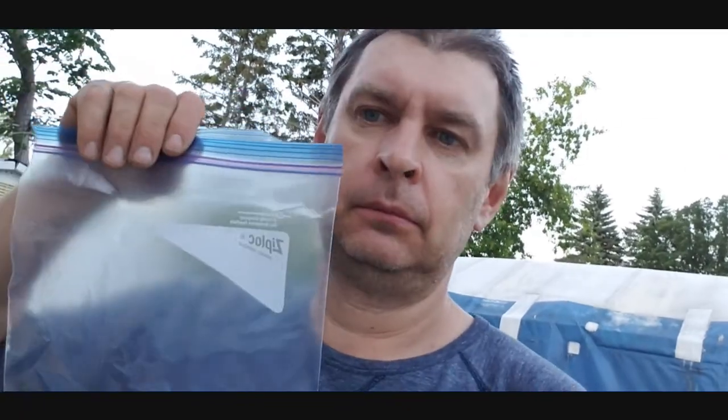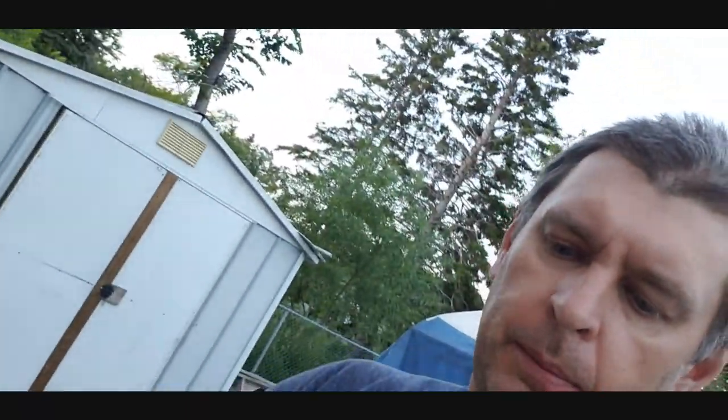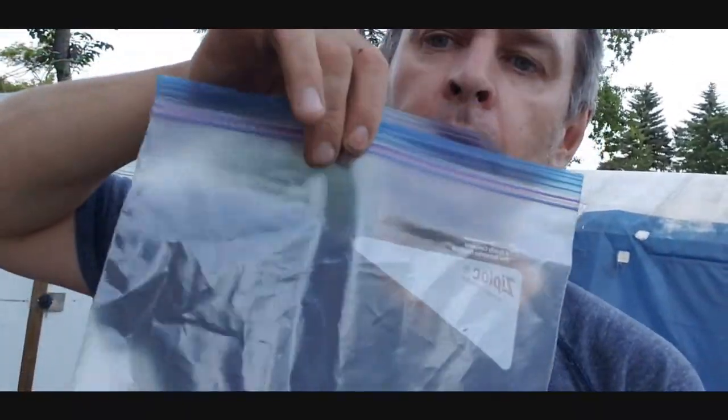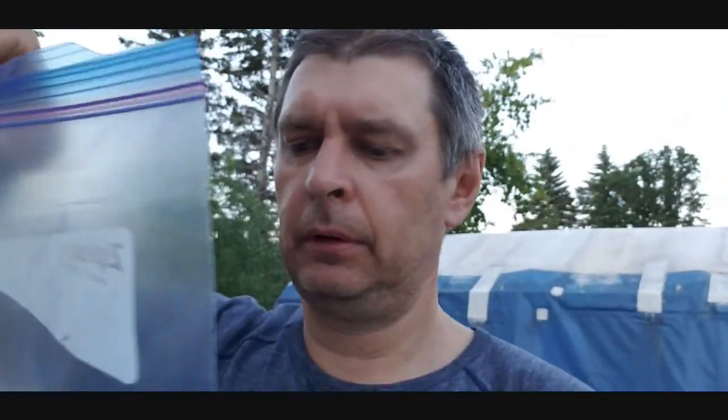Another important thing I forgot to mention, you guys. Before you dry it out completely and finish your spoon, keep it in a Ziploc. It will slow down the drying process. I usually close it to three quarters of the zip lock size and leave one quarter open and just roll it in. It will allow extra moisture to escape, but at the same time, it's not gonna dry this fast and not gonna crack the spoon.